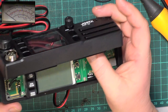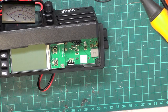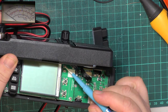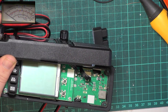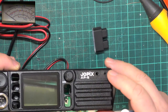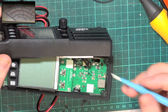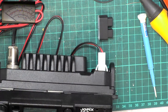On this one, unlike the Thunderpole T3000, we don't have three presets to the right of the display board — we only have two. We never did find out what the middle one did anyway. We've got two presets just there: upper one, lower one, on the display board. We know the upper one is AM modulation — we're not going to touch that, because we're not going to be bothering with AM at all. We came to the conclusion with the Thunderpole T3000 that the Kenwood standard socket there is really aiming at a Bluetooth dongle. So on the Thunderpole T3000, the top preset was deviation and the bottom preset was power.